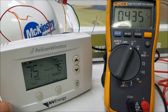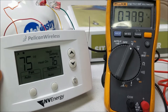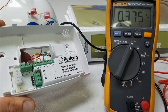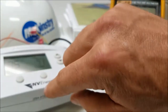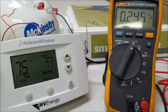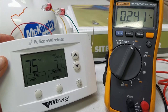That's it for this quick troubleshooting tutorial. As mentioned, you can control these relay outputs via your smartphone or laptop through Pelican's web interface. If you determine there's a relay issue, you can replace the wiring module. If it actually is a thermostat issue, you can keep the unique serial number — so after configuration and setup you don't have to redo everything through the web interface — and just replace the wiring relay. If the display goes bad, you can also just replace that versus replacing the whole stat. Thank you very much.